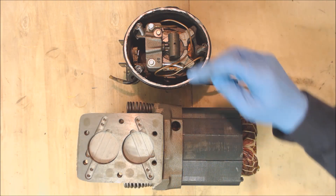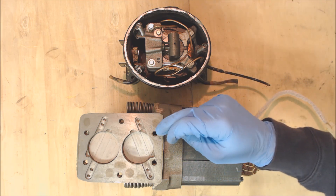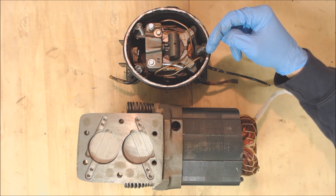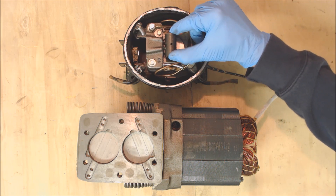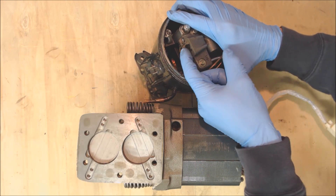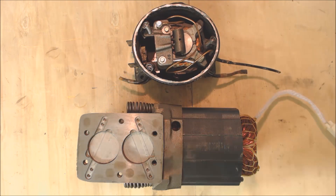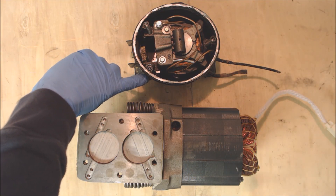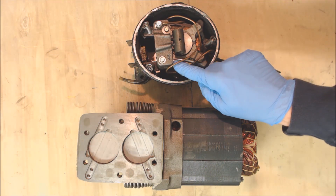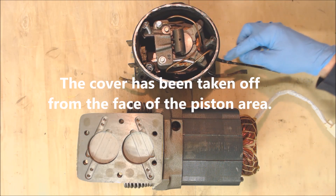This is the inside of two reciprocating compressors. This one was out of a four ton heat pump unit, and this one right here is a small refrigerator compressor — this one has a single piston in it. If you can make out this tiny little piston right here in the middle, that's all that is, and this one has two right here. On this compressor, the suction gas comes in here and it surrounds the electrical windings, and it ends up getting sucked right in here and then compressed by the piston. Then here's the discharge and it comes out right through this discharge line.